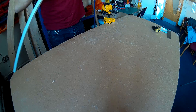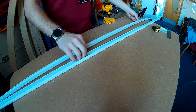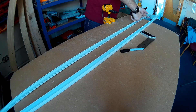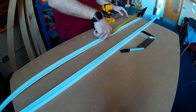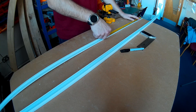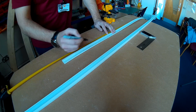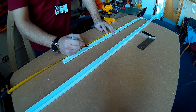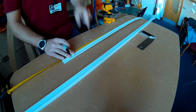Let's start by taking our trunking and measuring equal distance between LEDs. In my case, I've got 2 meters of trunking times 2, and I need LEDs to be 30 centimeters apart for each step, and then one in between to make it a little denser. I'm marking out the distances every 30 centimeters and then every 15 centimeters inside the trunking, which should give me 2 LEDs per step. Once all the holes are marked, it's time to start drilling.